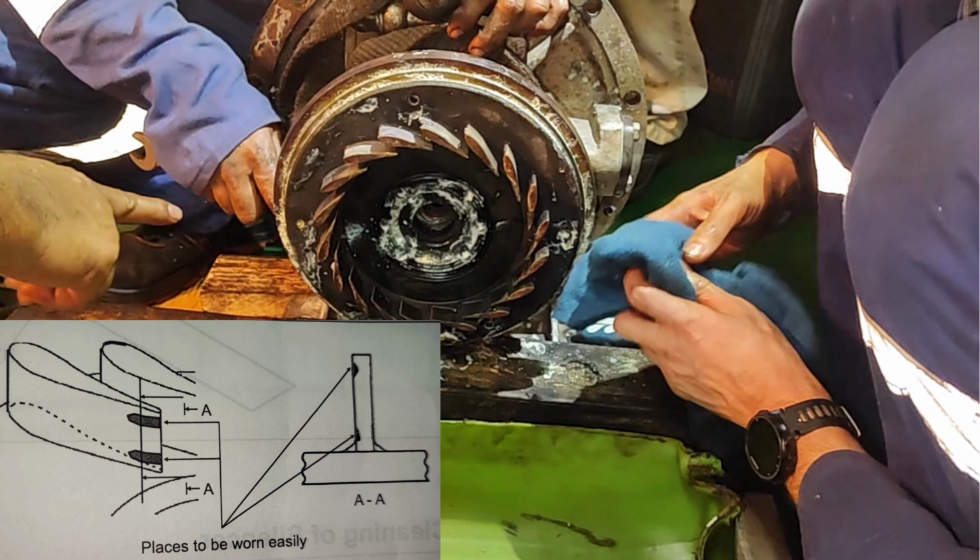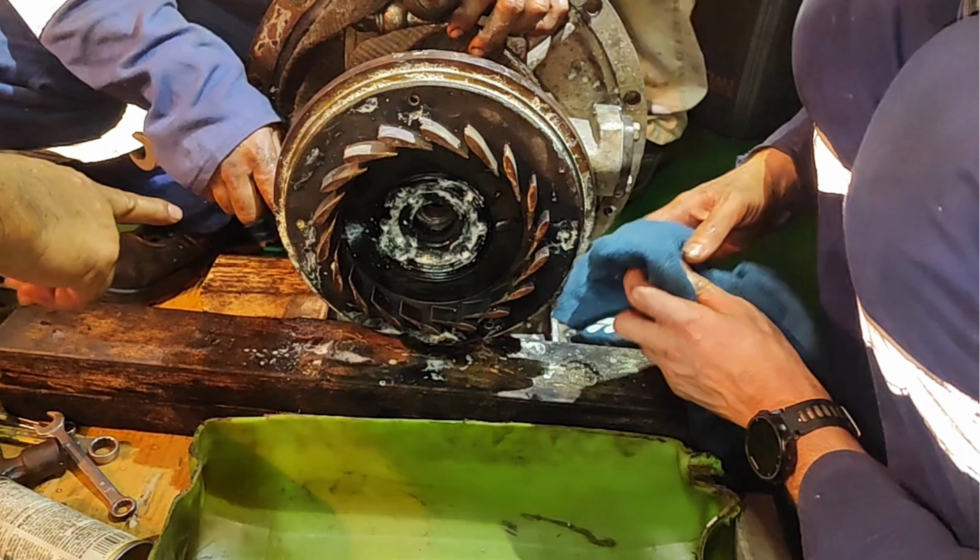After washing, visually inspect the nozzle while observing the following: uniform removal of fouling from the nozzle blades, formation by the nozzle blade trailing edges of a continuous line with no bending, uniform evidence of contact between the nozzle blade edge and the gas inlet casing.